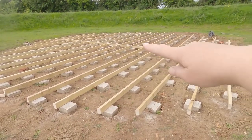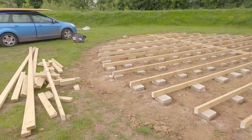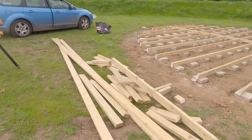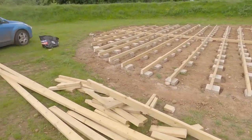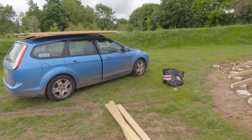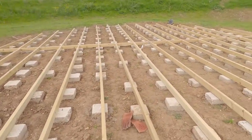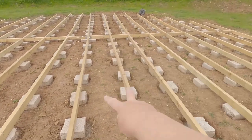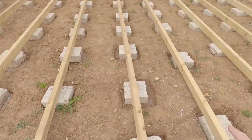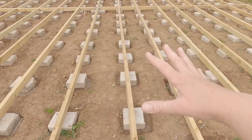Everything's screwed into the middle beam now and I'm happy that I've cut everything to exactly a 10-metre circle. I've got the chop saw and all my off-cuts left to go in for the cross beams. I managed to get four bits of sterling board on the roof of my car — God knows how because sterling board's slippery. What I'm going to do now is start from the middle, get the noggins in making sure it's exactly 1.22 metres on each side so the sterling board sits perfectly, then sit the sterling board on and screw it in as I go.